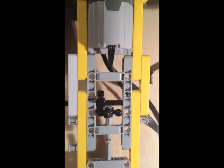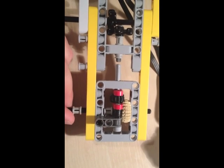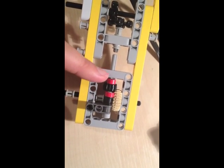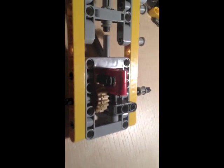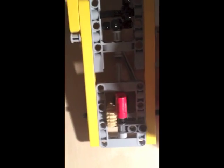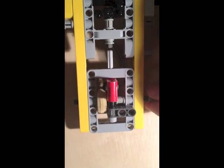My solution is to actually brace the tooth wheel, and even in this tiny contained space it is possible to do this by putting in these little pieces over here. I'm going to turn this around so you can have a look at it. Here you see the bracing that is possible, and with that you can very nicely transform the force and it doesn't skip.